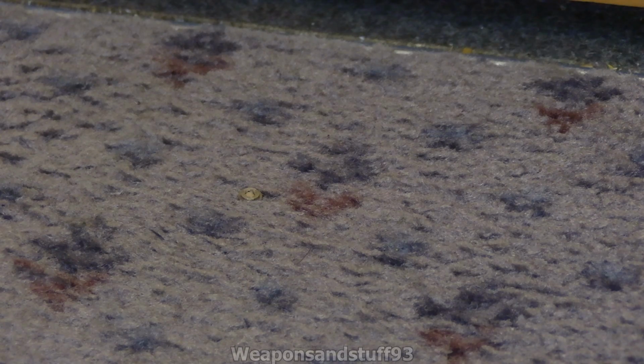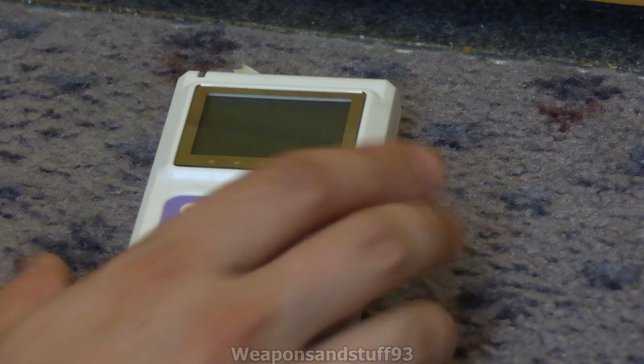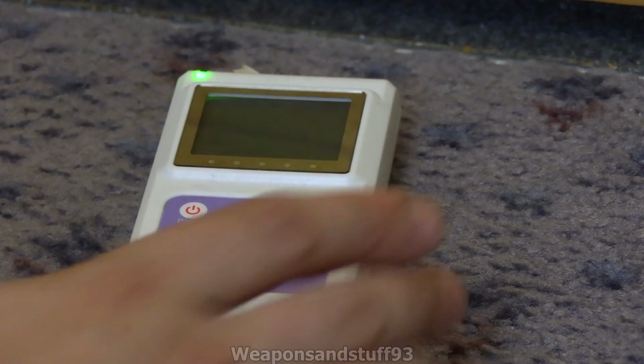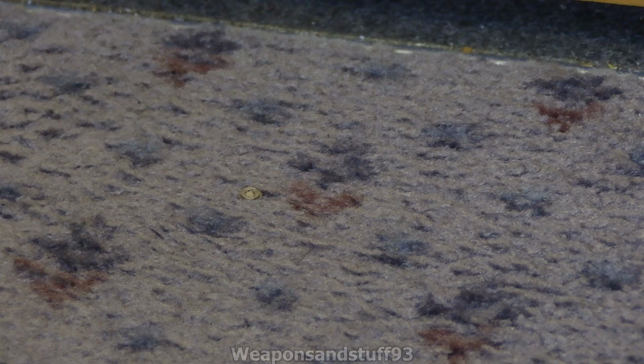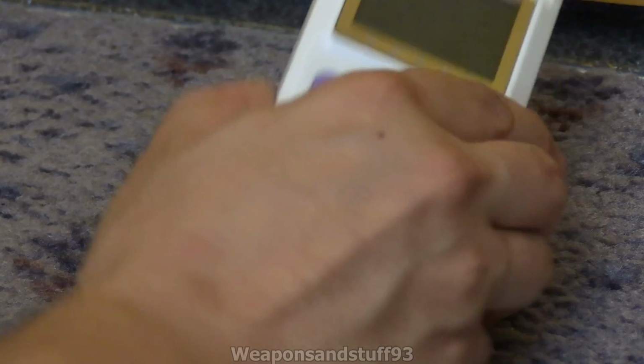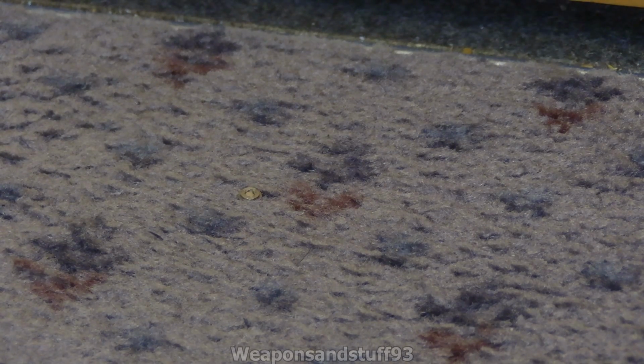What I'll just do actually is put it in the beta mode using this plate, just in case some of the softer... There we go, so you can see that's a bit higher there. Yeah, that's a better example. Because obviously if you've got a beta window, that's got an alpha window on there as well. With the alpha window open, it would be giving a much higher reading. But yeah, with this, you have to get fairly close before it picks it up reliably. That's not a problem with the Geiger counter, it's just the way Geiger counters work.